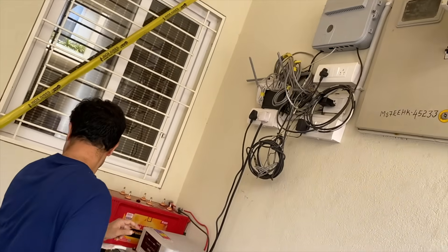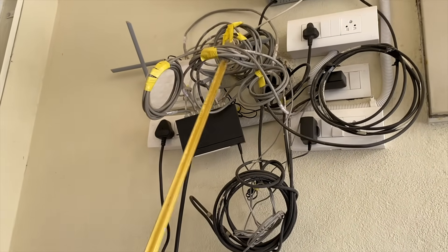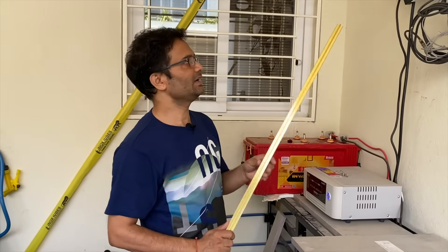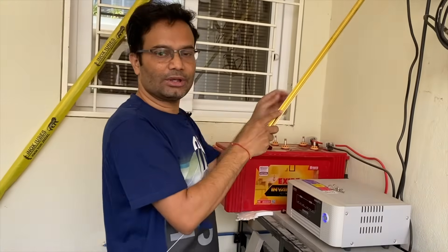Now let me show you the actual setup. I'll show the parking area first, then each floor with the Deco mesh, and then my office setup. There are two things: Wi-Fi connection through the Deco mesh and the wired connections. In the parking area you can see the broadband connection and all the Cat6 internet wires brought from all the bedrooms, TVs, and floors — nine wires total — coming here.